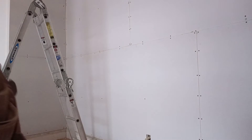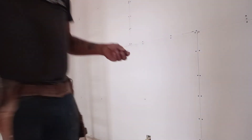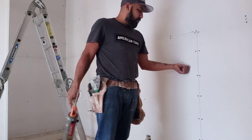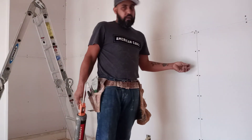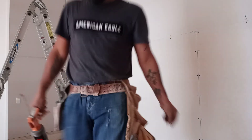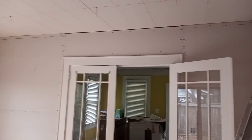I'm using glue and inch and a quarter screws because that's long enough to get to the wood. The plaster is only about half inch to quarter inch thick. In some areas like above the headers — above the doors — inch and a quarter doesn't work, so I have to use inch and five-eighths there.